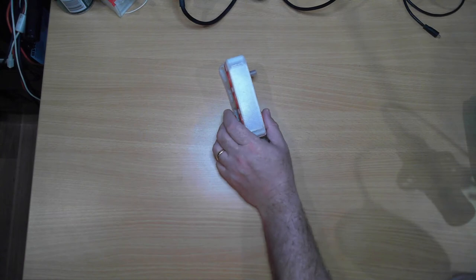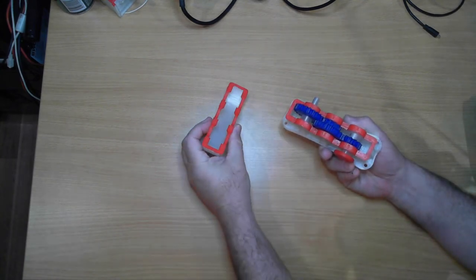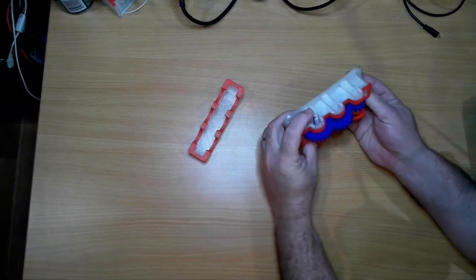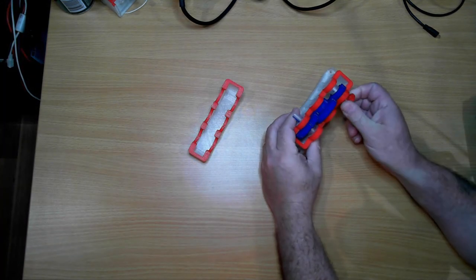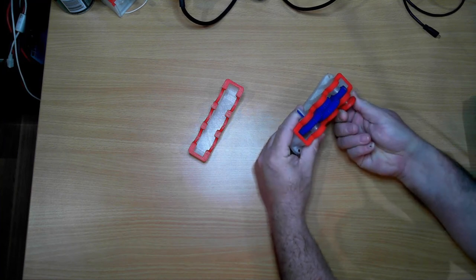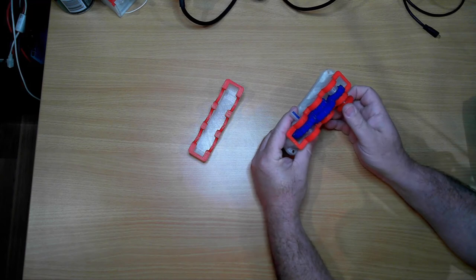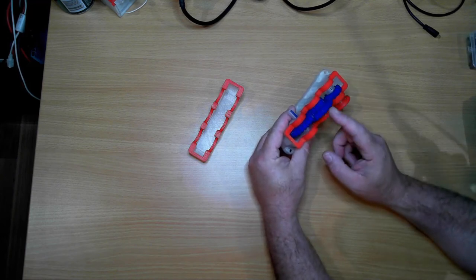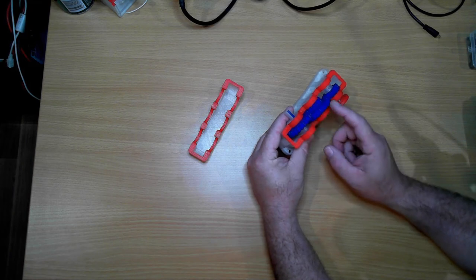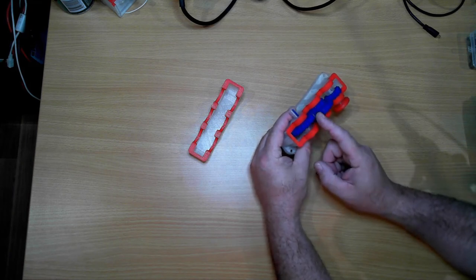Okay, so this build was an easy one. The Spur gear is a commonly used reduction gearbox throughout industry. This one has 12 teeth on the small gear and 23 teeth on the larger gear. It's then repeated with 12 on this gear and 23 on this one again.